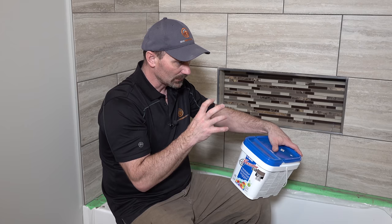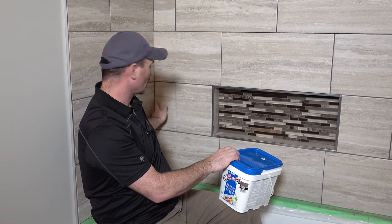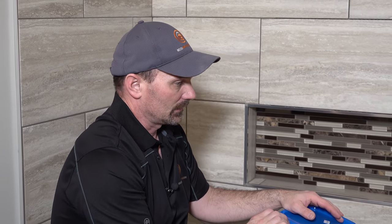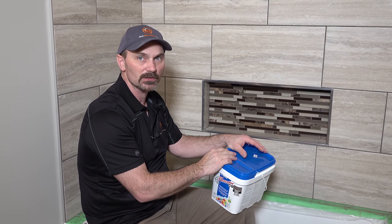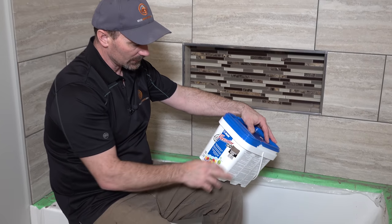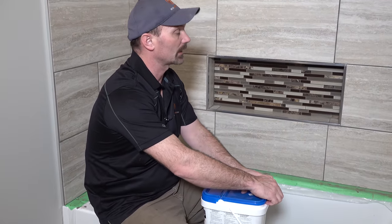It's got a little bit of flexibility too. What I find most times in a shower — when you have grout in an inside corner — most times over time that grout is going to crack because you get some different movement in the two different surfaces. I've never seen this stuff crack. I've never had any callbacks on it, never had it crack on my own products in my home. It just has that little bit of flexibility and it allows for some minor movement. It's a MAPEI product — Flexcolor CQ — and that's all I'm going to say. They didn't sponsor us, but this is completely what I use and would recommend.